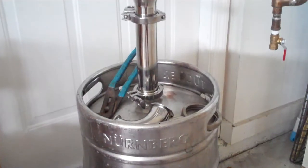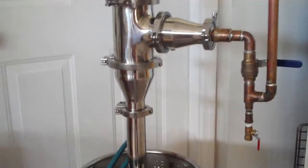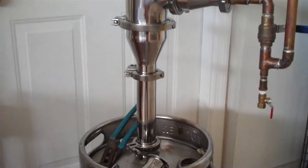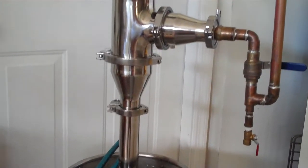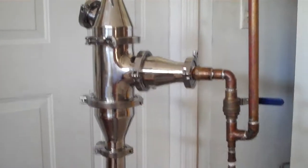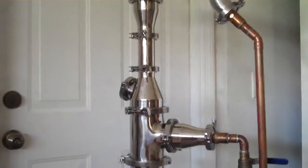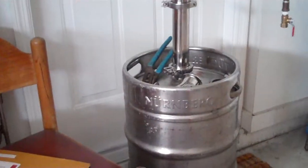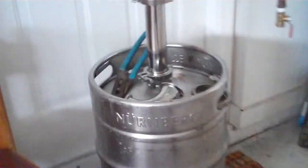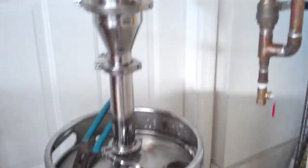And we need to do that by ensuring that this column, this apparatus, continues to purify as it cycles, so that the vapor temps at the top of the column and the liquid temps in the reservoir are maintained. So that way we will be exposing the botanicals to nothing more than added vapor speed rather than the heat that will ultimately be contained within the boiler. So in any case, bring the thing to temperature.